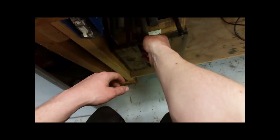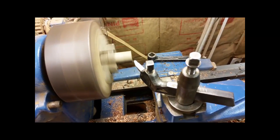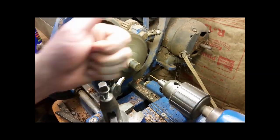So, first, get the ebonite you want, and you choose the diameter that's appropriate for the pipe you're putting it on. You cut it to length, and that's one of the things that we'll get to in a week or two, is talking about how to choose stem length and style and things like that. So, you've cut your ebonite rod to length, and you're going to throw it in the lathe here, and you're going to turn down the button side, facing the smoker here, and you're going to drill out at 1/16 the pilot hole for the slot.